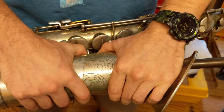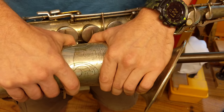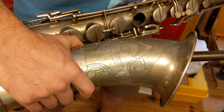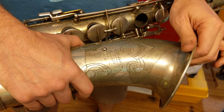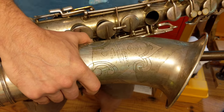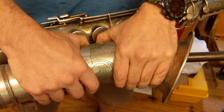Now we're starting to get to stuff that isn't quite so sharp — it's more just like the sax bell in general is misshapen. Right on the S there's kind of a ding, so I'm going to use a magnet. The dent ball is pretty big so it won't get me right on the center, but it should get me pretty close, just to make sure I'm not in the wrong spot. And I can watch what happens to the dents as I push.